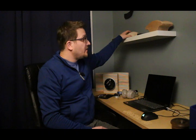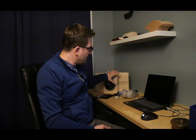My subjective listening impressions: the mid-range is very transparent and open, however I was detecting a bit of harshness at around 10 kHz and up — consistent with the burst decay issues seen there. In a previous test I used this combination with a super tweeter crossed at 5 kHz. However, the off-axis is good enough to use this in a two-way application, assuming the compression driver can play up to 20 kHz.